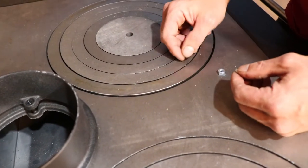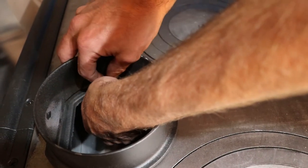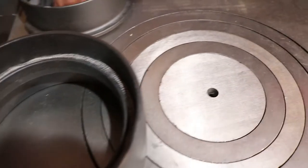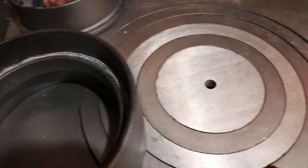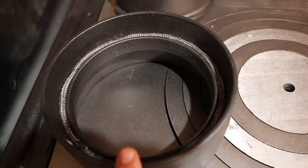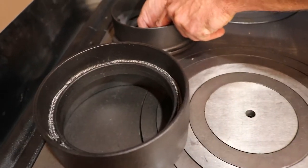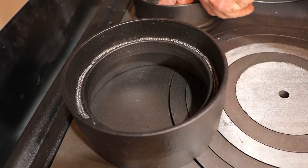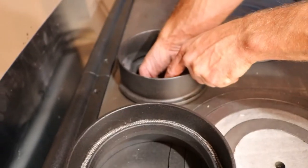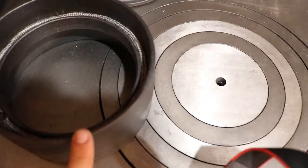The gasket is going to make it airtight across the cooktop. We put these screws into place — they also give us bolts to secure them. The second gasket is going to be installed into this piece, which is then going to sit directly on top of that, making the airtight connection. Your pipe will fit into that — if you're using a single wall pipe it'll fit directly into this second adapter. If you're using a double wall chimney, you will need that stove adapter to match whatever brand of double wall chimney you are installing. Just like that, we have it tightened into place.